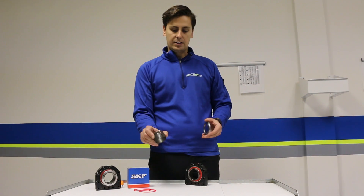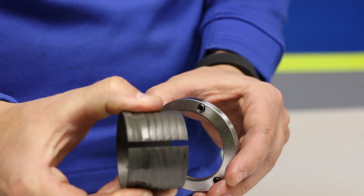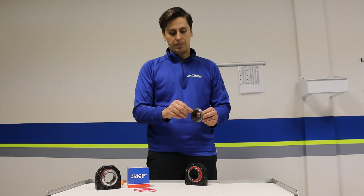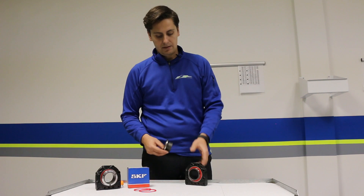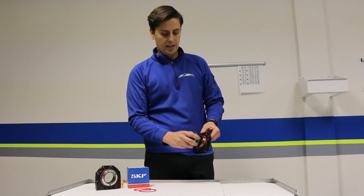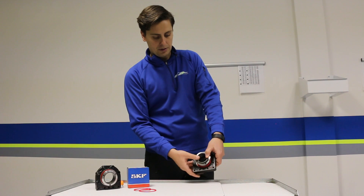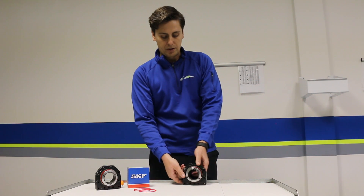You take this piece here which is slid on the backside — you can just push it together fairly easily. Push it together and you slide your locking ring all the way to the outside until it bumps up on this ridge here, and then you know you're good. This piece then simply — you give it a little bit of a squeeze and you actually push it right inside the bearing. Once you have it in there, just give it a little bit of a push and you're there. So now you've kind of installed your bearing.